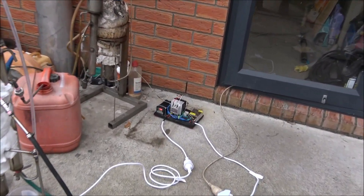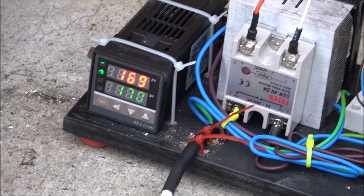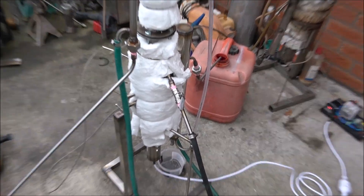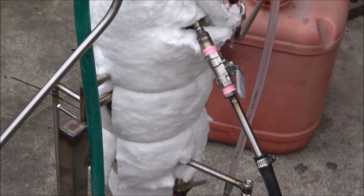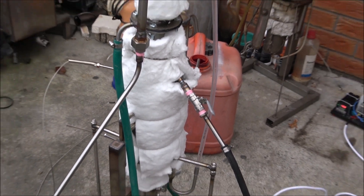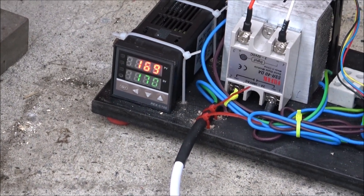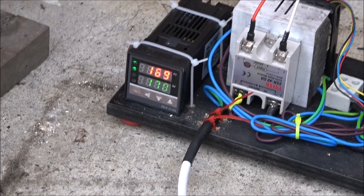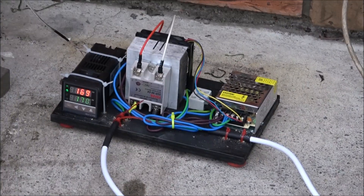Here's the control unit and it's set at 170 degrees. Now we've got 169 degrees because of this valve. This valve and this tiny valve actually controls the supply flow, and supply flow controls the temperature. So you're opening up the supply to make the still run at approximately the temperature that's been set on this control device. It will keep at 170 degrees — it won't let it go any further, any higher. So you're controlling with this valve, but this control unit actually helps you to keep it within the temperature range.